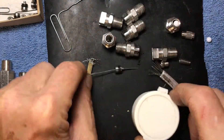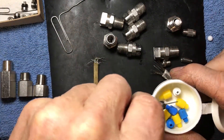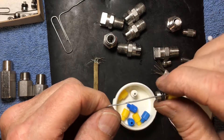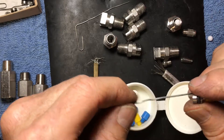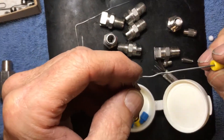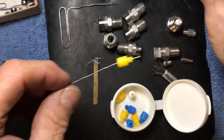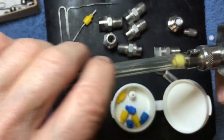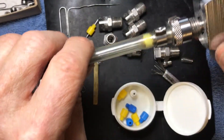The little yellow metering tips we use on our injection sprayers — that same small paper clip goes through. So it's a good test to see if you've got the right size nozzle bushing. The bigger paper clip won't go through — it's not supposed to. Good way to unclog your little yellow metering tip in your siphoning injection sprayer is to pull off your tube and run your small paper clip through there. If it still doesn't flow, you probably need to send it in.